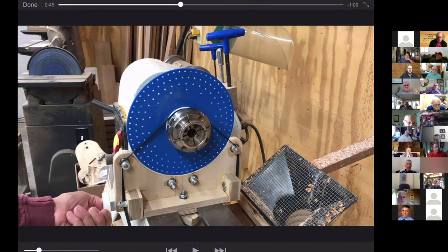But anyway, you can make the pulleys any diameter you want. The next pulley, the one I showed you at the opening and I held up, that's a 4-inch, and it produces about a 28 degree per inch of rotation. 28 degree rotation per inch of travel. And as you go bigger and bigger, up to maybe 6 inches, 7 inches, you get down to where it's a very long, shallow helix.